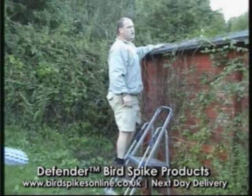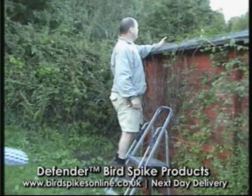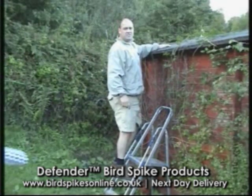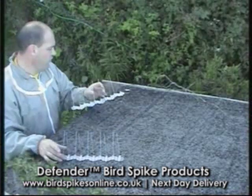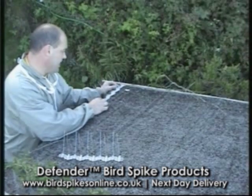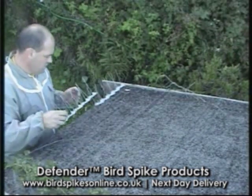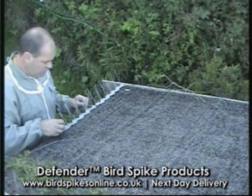Here we've got a shed roof, which is quite a big flat area, and I'll show you in detail how I would deal with this situation. First thing I would do here is put my first piece on. I would stick that down level with the edge of the roof like that. My next piece I would go along doing the edge.